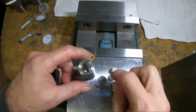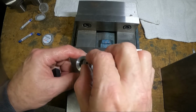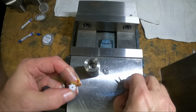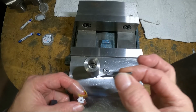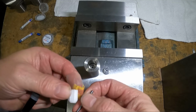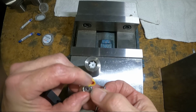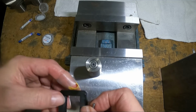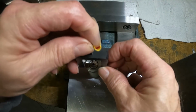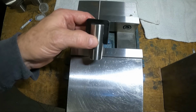Here's the two bearings and the little impeller. So you're gonna stick this first bearing in here, and then the tool's gonna go through it this way. You want the chamfered end at the end of the tool, like this. Stick that in there like that. And this other bearing. Then you start your tool in here like this. And you stick this whole thing on the assembly.